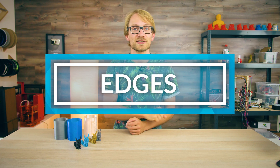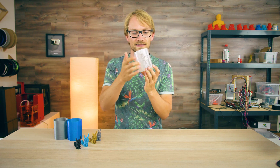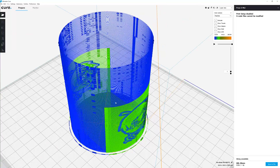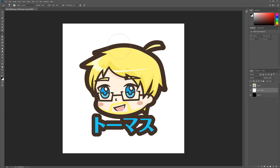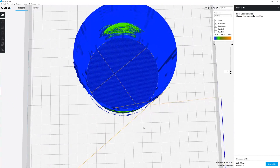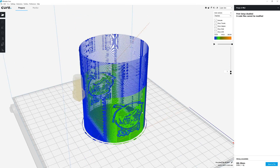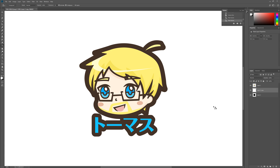Number 3: Imprint designs without edges. If you look at these prints, they have that frame-like border around where the design ends and the rest of the print starts. To get rid of these edges, you have a few options. They all center around blending the speed of your edges with the non-velocity-painted region. White is fast, black is slow, and the Velocity Painting tool uses the slowest speed for anything not covered by your image. So if you fill the background of your image with full black, it will just blend perfectly. You can also add a black border on the left and right edges of your image and feather it in, which at least smooths out the transition. Or, very simply, make sure your image covers your entire part when using the X, Y, or Z projections.